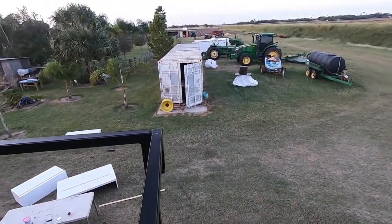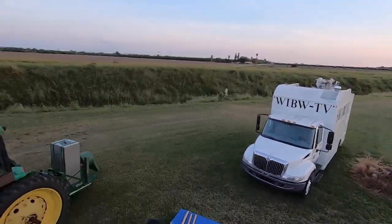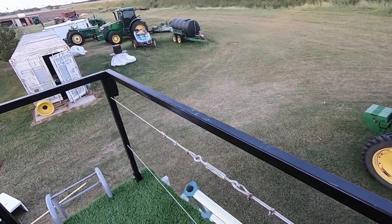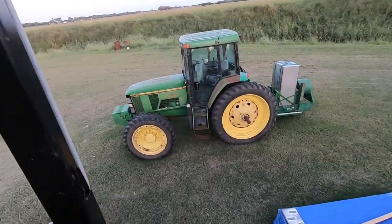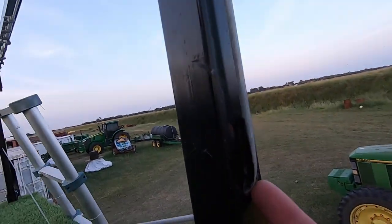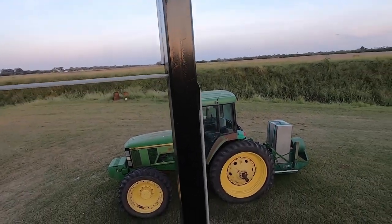All right, so like I mentioned before, this back rail is slotted in on both sides. And then once you pop this rail out, it's just these two side rails that are really holding everything up. But I didn't want everything to be supported by just this slot-in rail. So to add some added security, I did a cable system, and I just took the little eye loops at the end, which you usually use to tie off, make a loop at the end of a cable. I just slotted that into a hole that I drilled, so it'll keep the cable from being cut. So I added that on all the spots wherever there's gonna be a load pushed on the cable.